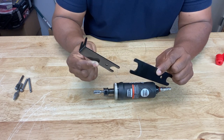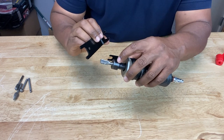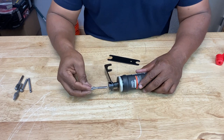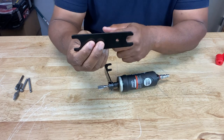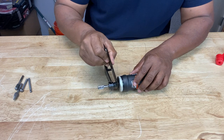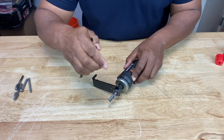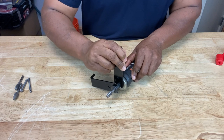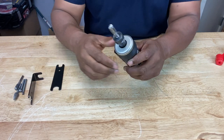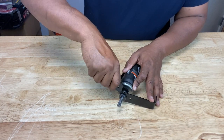You're going to take the angle wrench and place it onto the flat parts of the spindle. Then take your burr, slide it in, and use your other wrench with the smaller span to place it onto the flat parts of the collet nut, and twist to tighten it. To take the burr out, simply place your spanner on the collet nut and twist in the opposite direction.